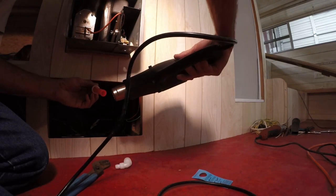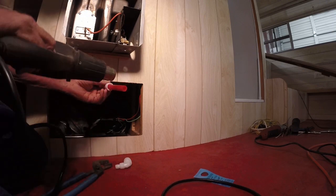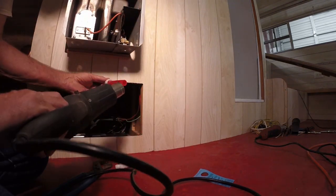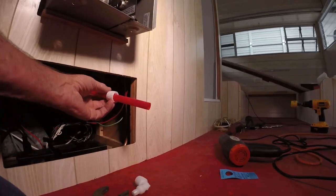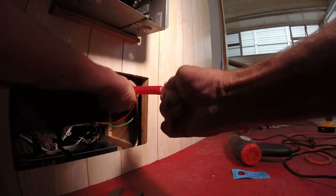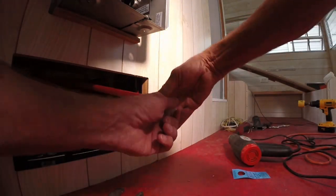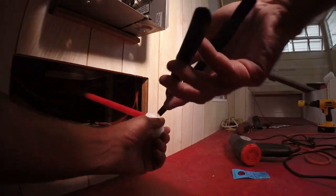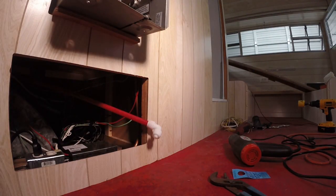It doesn't take long to heat. Then you just shove it onto the fitting until it's flush, and screw on the compression nut. Tighten it by hand as much as you can — when you hear it squeak, that's supposed to be good enough. I give it a few more turns with the channel locks just to be safe. That's it for connectors — that's how it's done.